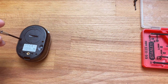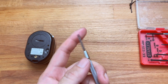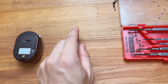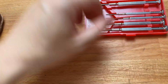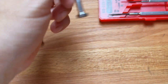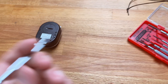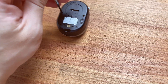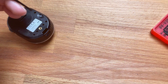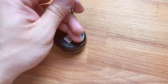You can have the proper ISO and the proper exposure. The tools you need: a JIS cross-point screwdriver, used to service a lot of Japanese 35mm film cameras, and also a slotted screwdriver of an appropriate size. This little kit actually works great. Let's open up the light meter — just two screws — and you don't even have to remove the battery. The battery can stay in there because the light meter separates very easily.